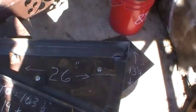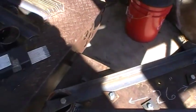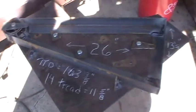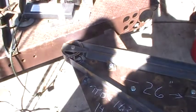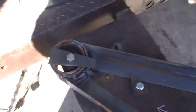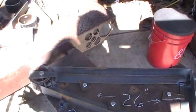I've watched a lot of videos on YouTube, and I'm really making this one like a manufacturer would. I've seen guys just stick them on and weld them, but I wanted to do mine differently — that's why I made this jig, to make all the treads exactly the same, and then they set-screw on, so it's adjustable. To reduce error, instead of using a spacer, I'll lay the whole pipe out first and mark 8½ inches between each line, and each tread will go to the 8½ inch mark. That way, if these little pieces are a sixteenth over or a sixteenth under, it doesn't matter — it all comes out in the wash.